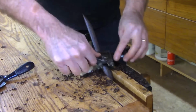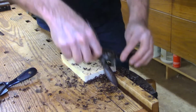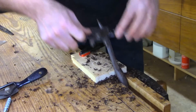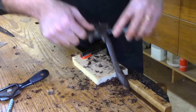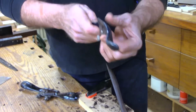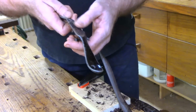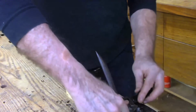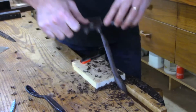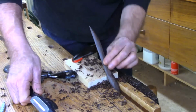I'm not sure if you talked about this. I don't recall, Tom, but David's asking coarse versus fine spoke shave. Is it a matter of how exposed each blade is? Yes, yeah. It's just how aggressively I set the cut. So this one's set quite thick, take a heavy cut, and this one's just closer, very fine, more controlled, and you get less tear out. See how it's just more civilized here, where this one's taken off an aggressive layer.